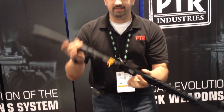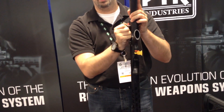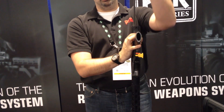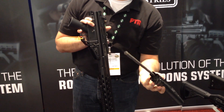I'll give you a quick breakdown of the rifle. You've got two pins in the rear of the stock that pull out here. They actually store right in the stock so they're not lost during field stripping. The stock pulls straight off the gun. That's your recoil guide rod. The recoil guide rod's spring and your bumper system are assembled in the housing.